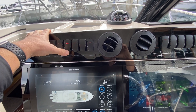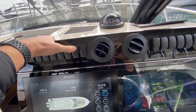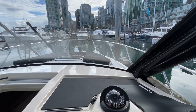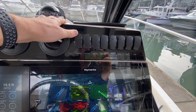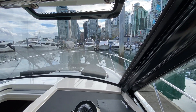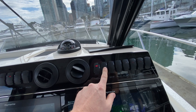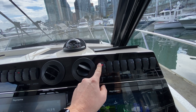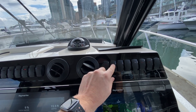This is manual override for the bilge pumps, manual override for the forward bilge, sunshade forward and aft, the defroster on the windshields. When you want to use your anchor windlass, you turn it on here and then control it up and down, but you can also use the controller up on the bow. In order to use the bow controller, you do have to have it turned on here first — if this is off, the control on the bow will not work.